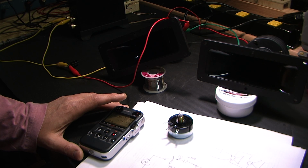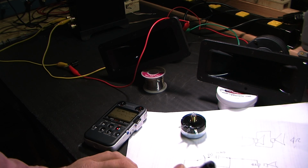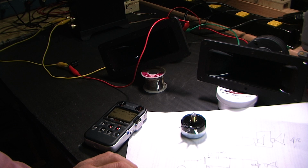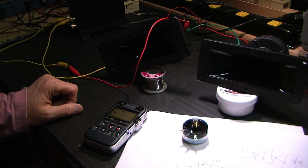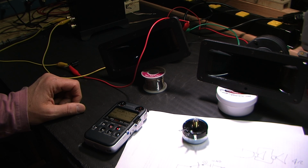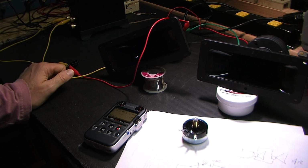Let's go down to 1K. It should attenuate even more than 5, and what we're seeing here is that tweeter dropping off in its crossover region. The fact that at 4K we're at a 5 decibel difference is completely unscientific, because I'm virtually guessing, not guessing, but it's very rough in terms of me even deciding that 4 kilohertz was the crossover point.